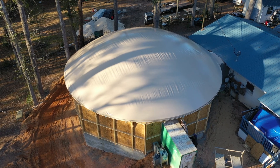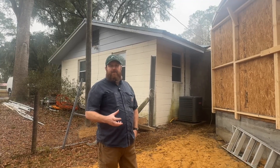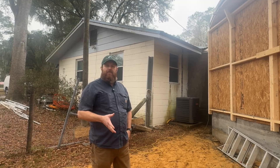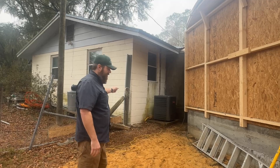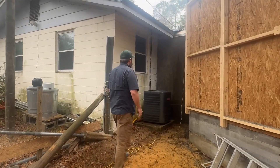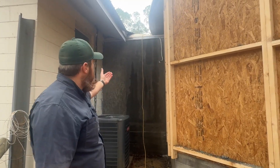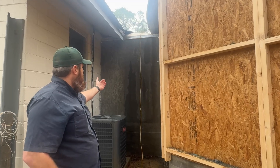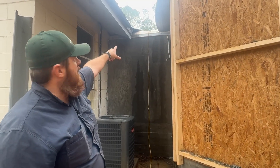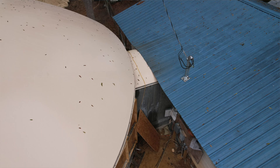So this dome is an Orion, and we're going to go take a tour and see what it looks like. The other thing that's unique about this dome — and we don't do it super often — is that this dome is actually hooked to his existing house. This concrete wall that you're seeing is one that we had formed. We had the plywood forms here and actually sprayed these concrete walls just like we spray the dome concrete, but we did it from the inside. We actually inflated a little square air form on top to give that roof a little curve, because those curves are what make things strong.